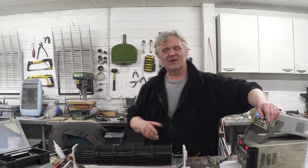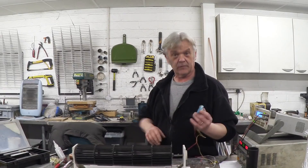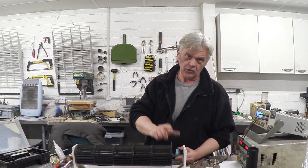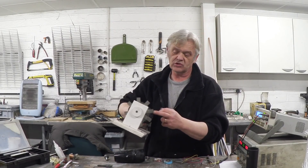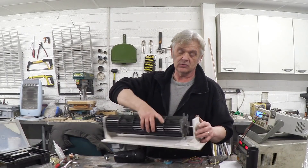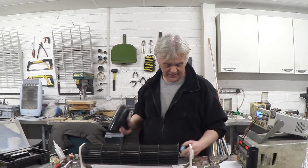I've been going on a lot about switch reluctance, so what I've done is taken the blue coil we just used and stuck a couple of magnets on the back. Holding that close and giving it a spin we can see the effect. I've torn all the magnets off the rotor and what I've put onto the end are strips of steel cut from a microwave oven transformer — thin laminates, a single laminate of steel — in a crisscross of eight.